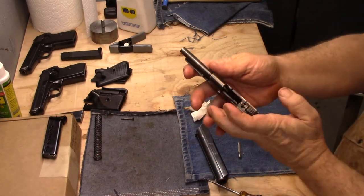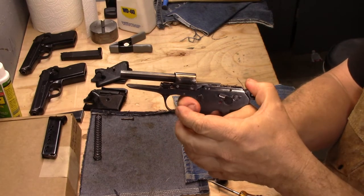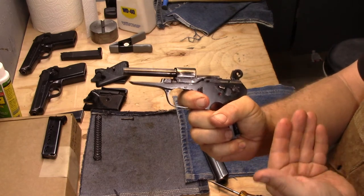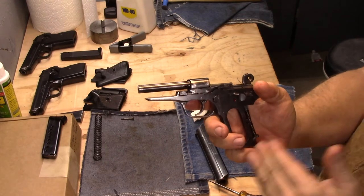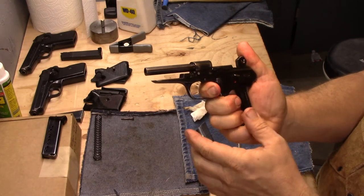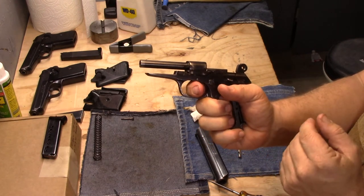The reason why is because there is a piece in the pistol — part of the trigger mechanism — that will raise. It's raised when the trigger is pulled back. That is what pushes the bar up and allows the firing pin to move. So in this configuration the firing pin cannot move. Not only is the hammer stuck in a rear spot, because the hammer only goes forward all the way when the trigger is depressed, but the firing pin cannot move until that sear component is raised.